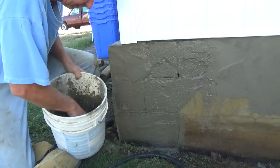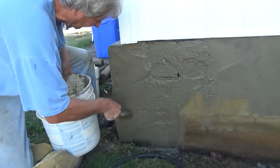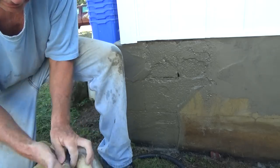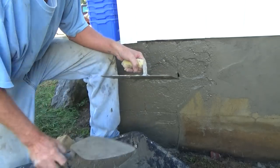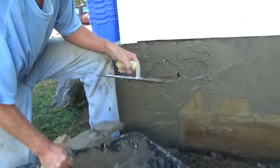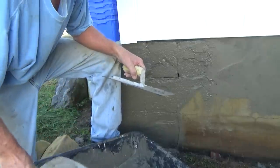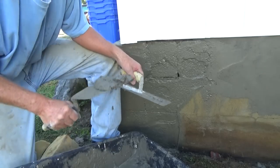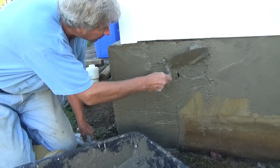You know, you get better as you do this stuff. I always say start at the back of the building, just a little spot the first day, and practice, and you'll get it. You're picking up a trowel full of cement. You want it to stay, you go like that, you see? And then it stays. If you don't do that, you pick it up and you turn it, it falls out. You go like this, it stays. So, just to remember that.